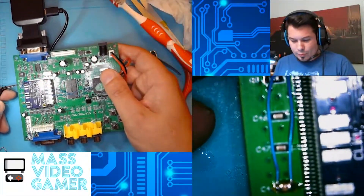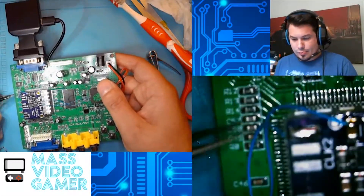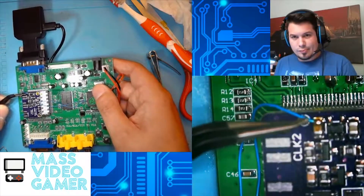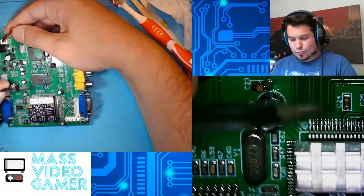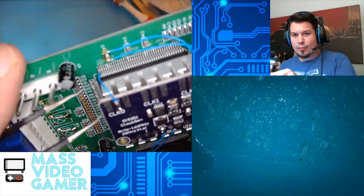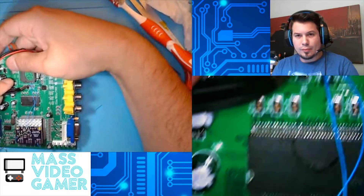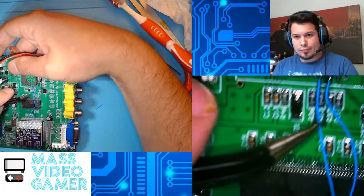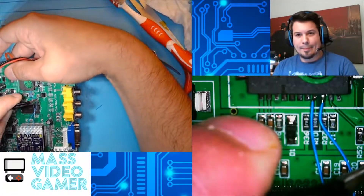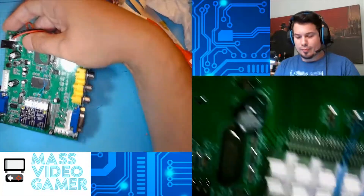So, to recap what we've done today: we have the left side of C48 soldered to the clock 2 pad. We have the right side of C48 going to the capacitor on the clock generator board itself. We also have the 40th pin on the TruVision chip connected to the middle clock pad of clock zero. And we ran our wires for the SDA and SCL pads — pin 15 all the way to SCL on the clock generator board, and pin 16 criss-crossing over to SDA on our clock generator board.